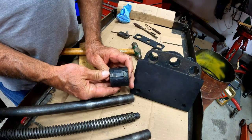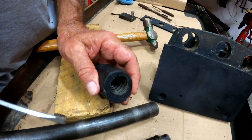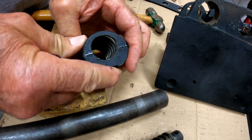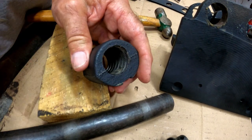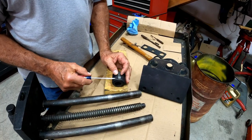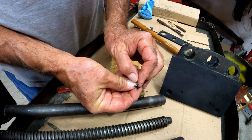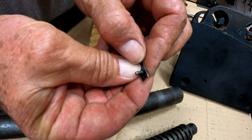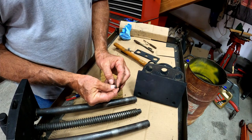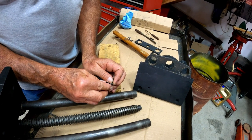When you slide that off, this piece comes out and you can see it only has threads on this side — there are no threads on the other side. You can also see this pin right here floats up and down. To get this pin out, just stick a screwdriver in carefully — you don't want to bust your spring. It's like a little nail with some spirals in it, and those spirals grab the metal and hold the pin in. You can see how this spring comes down and dips at the end, so make sure you have it in the right direction.